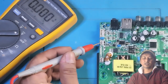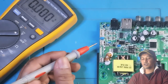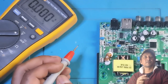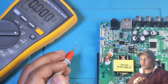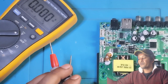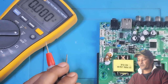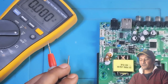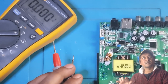But on this TV, I don't think it's going to use 78 volt, because when I checked, those backlit is three strip. Each strip has seven backlits, so altogether is 21 backlits. And when I was testing them, it was operating on 2.5 volt. So 21 times 2.5 volt, this should provide about 52, 55 volt to this TV's LED strips.